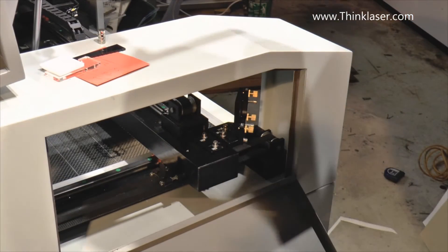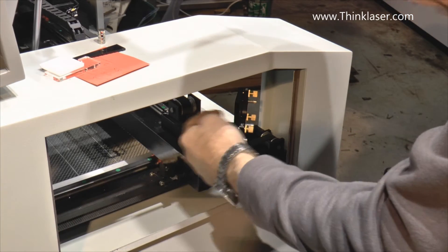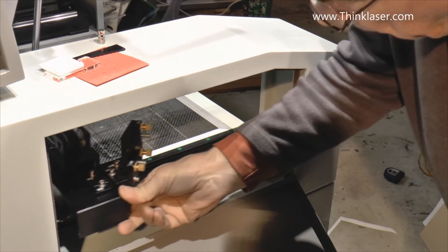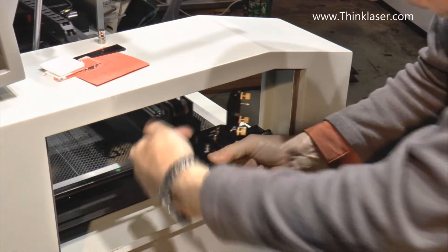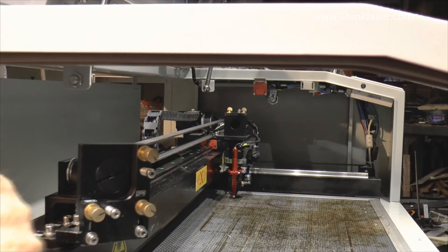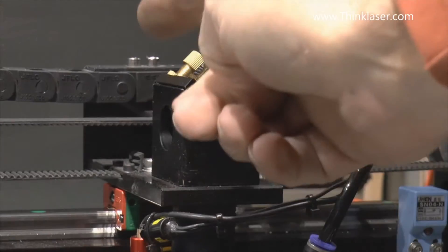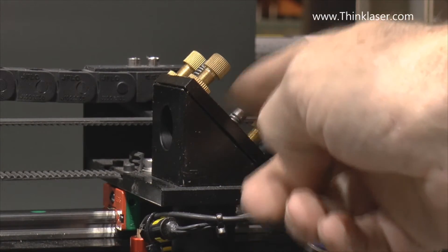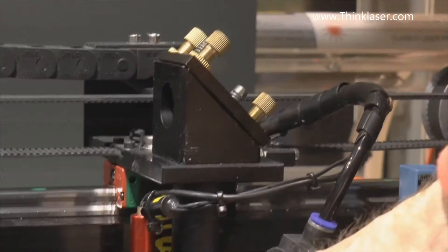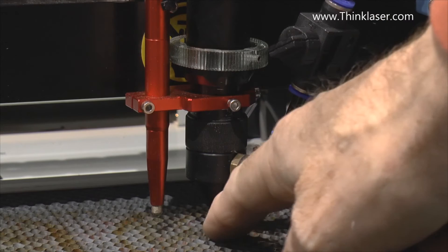Here is the second mirror. Once the beam has turned the corner it fires across the machine onto this second mirror, and regardless of where it is on the machine, the laser beam hits it and at 45 degrees it bounces off, hopefully parallel, and arrives at the cutting head. At the cutting head there's a third mirror where the laser beam bounces off at 45 degrees and gets directed downwards towards the lens, which concentrates the energy and fires it out of the nozzle.